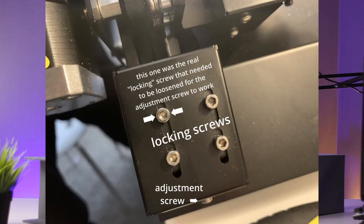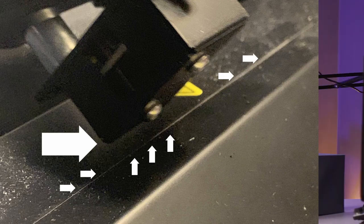For starters, the bed really needed adjustment. Turns out it couldn't go high enough with the current endstop. After figuring out how the optical endstop does work, it's just an adjustment screw on the back with some screws for securing and tightening the whole thing down. The bed can also be lowered so that the belt is more in line with the end of the printer. And a fun little side effect — well, is this. It clearly didn't come that way. That's a nice little feature that I got to see firsthand the print head making on its own.